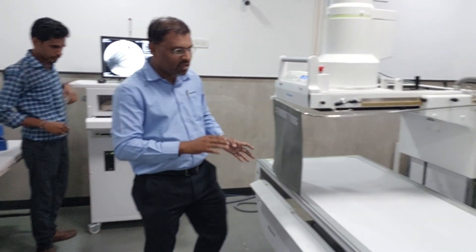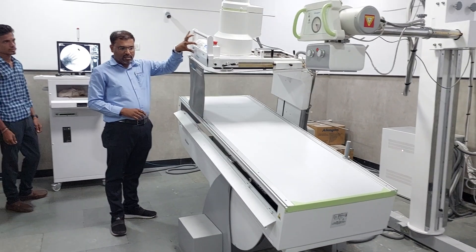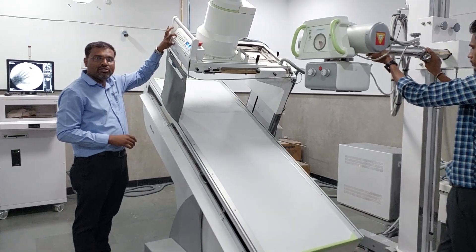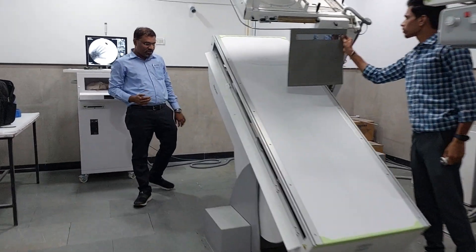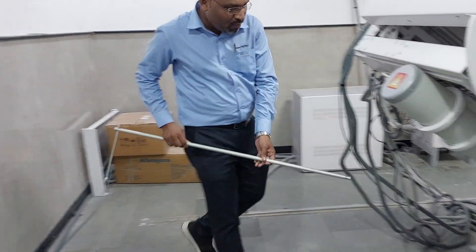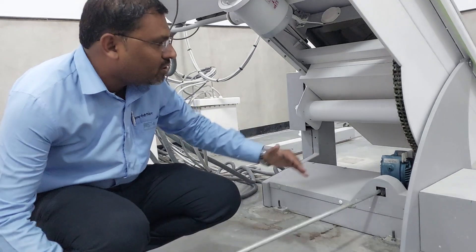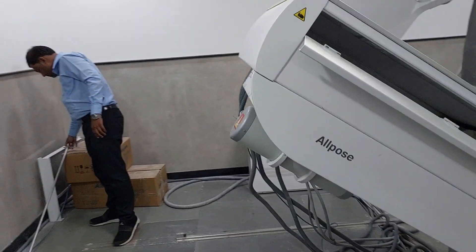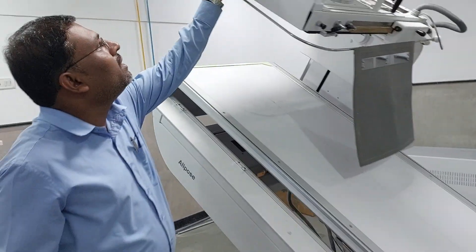One more thing — sometimes during the procedure the technician will move the II completely in the upward direction and sometimes the machine will not turn in the reverse direction. At that time the machine will get stuck. To handle this situation — come close — they have provided one rod with the machine and one reset switch here. You have to insert the rod, rotate it in the anticlockwise direction, and it will come down. That means your motor gets reset when it is stuck at a particular position and you can make it come down. Perform this only when the machine is stuck at a particular position — the machine will be released and come back down.